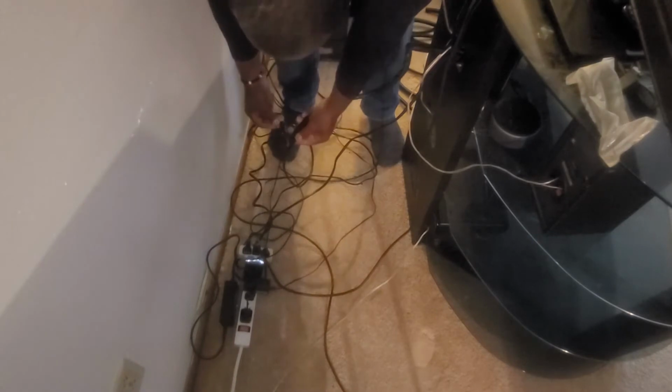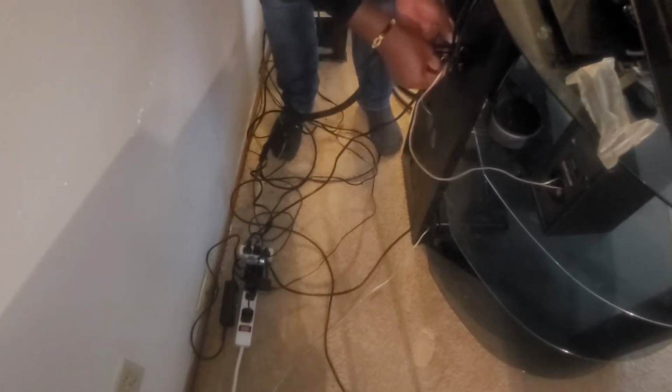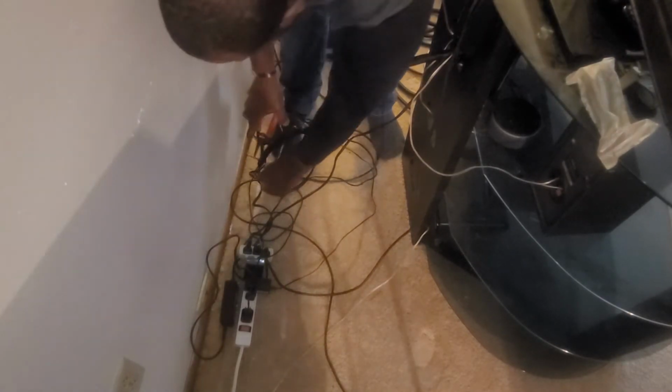At both ends of the tube, you can use tape or tie strap to prevent the wires from pulling out. Now I will just continue and place all wires in tubes. The wires are coming from various directions and some meet up here. To make this presentation a little better, I will use the black electrical tape to tape at the end here.